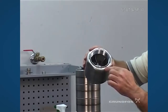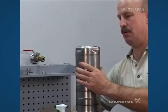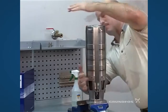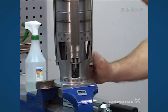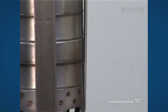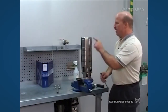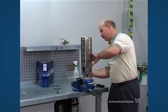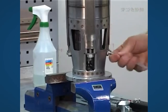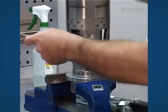On the discharge piece, you want to line these up with the bottom piece down there where the holes are from the straps. We have a tapered area on our 17mm wrench. Then tighten it, making sure that you tighten from side to side, just like you would on a tire. It's important that this is done in three steps to make for even tightening of the straps so that you don't get your pump bent at an angle.